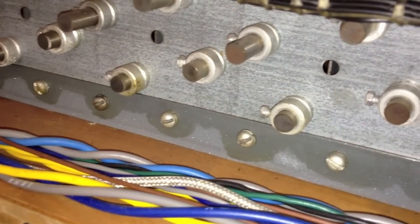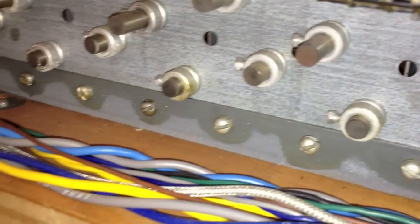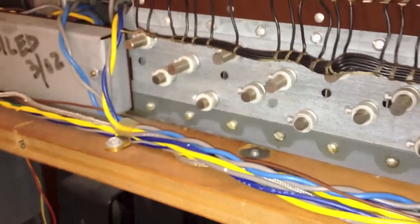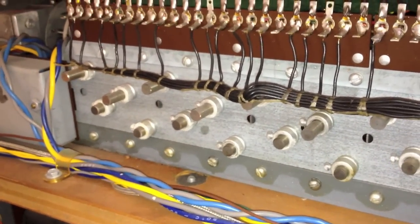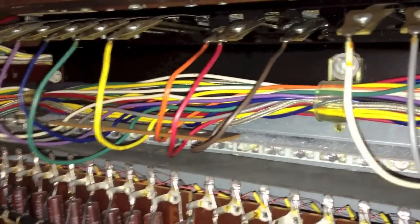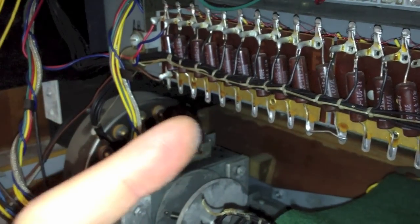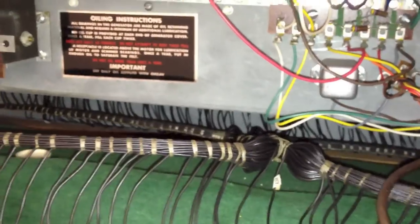It's bone dry. See how the metal kind of shimmers right down at this part? Those are steel parts coated in zinc, which they did to protect them from rust and oxidation. Over time, what they couldn't have known then is that this zinc coating tends to migrate and form itself into little fuzzy things. When these parts are really close together — like inside the amp or inside the vibrato scanner — they can create unintended circuits and connections that short out other parts of the organ. See how it just sparkles and shimmers? That was supposed to be smooth — if I wipe it, now it's smooth metal again. But there are these little whiskers on my finger. Not deadly, not going to hurt you, but definitely has the potential to short out parts of the organ.